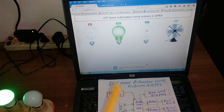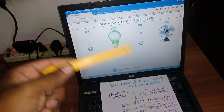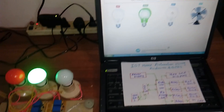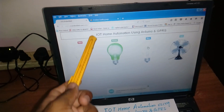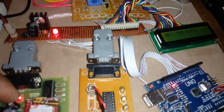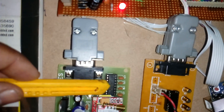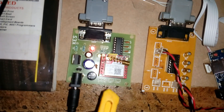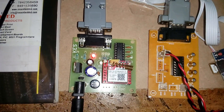This is the PHP code continuously executing on the server. When we press or click, the action goes into the PHP code at svsembedded.com/bulbs — that is the root URL. Here we are using a SIM800L GSM module with one SIM card — Tata Docomo — and enabling the GPRS settings on it.